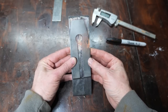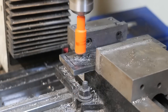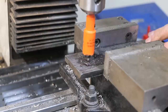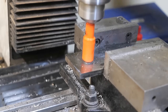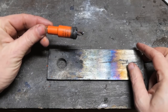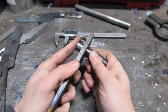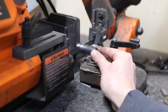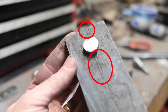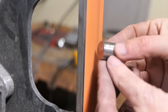Now let's cut a hole in the blade so we can get our chocolate into that peanut butter. First we had to mark out where we need to put our hole. The blade is currently oversized a bit and will stay that way for a while in case we get something off-center. Despite the fact this was annealed, I still burned up several cheap Amazon hole saws. The plug fit the real piece perfectly. Those creases you see in the blade — those aren't delaminations, there's a defect in the die on my press and I had to go back and file that flat.